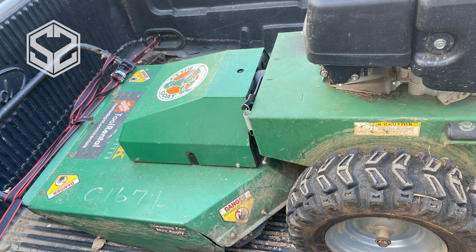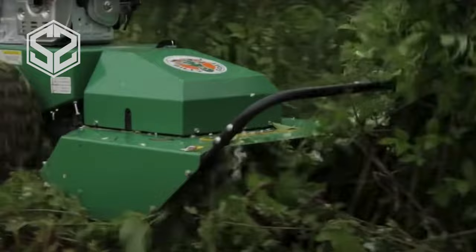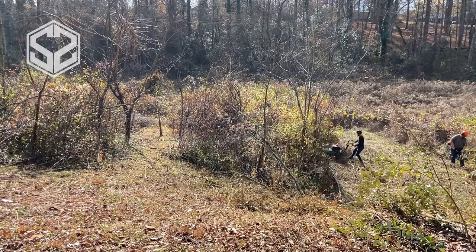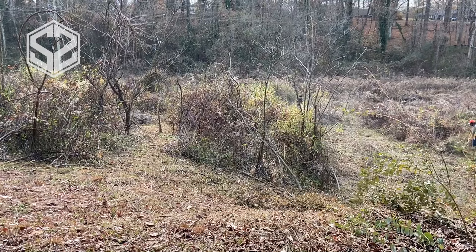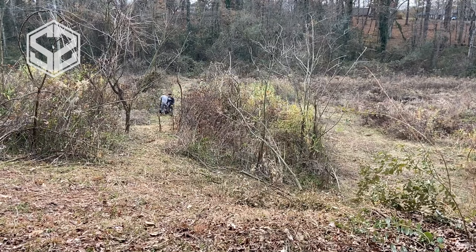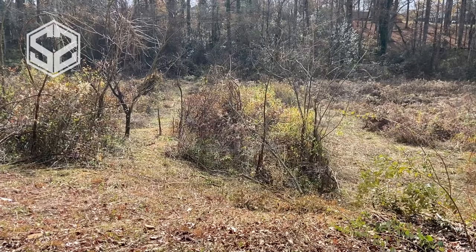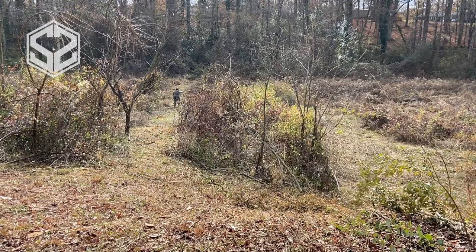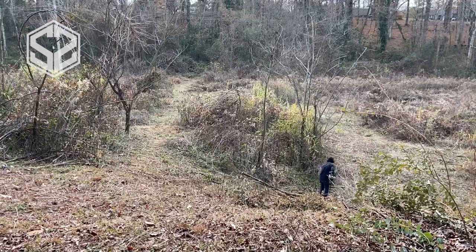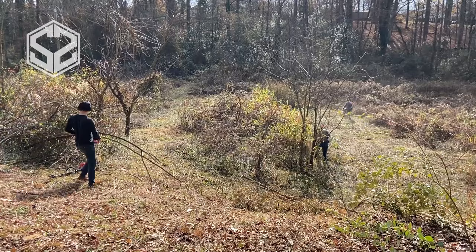I'm going to rent this for a day and see how far I can get with it as well. This is self-propelled — it has a couple gears forward and a reverse. But that doesn't mean it's going to be super easy. I found out this is a lot more difficult, especially if it's really thick thorns or brush. It was pretty much lifting the brush hog up off the ground as it tried to plow through it, so you had to back up and go at it again. A brush hog like this is limited to cutting anything up to two inches. Anything bigger, you'll want to use a chainsaw, which I'm using to thin out trees so the brush hog can easily go through.